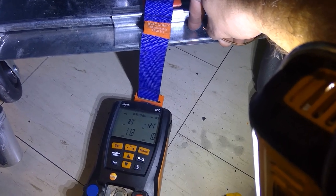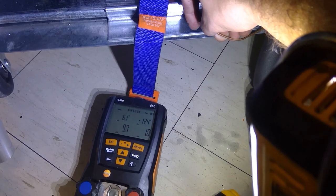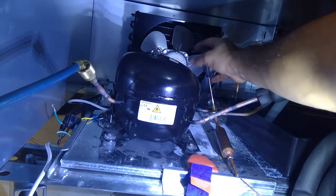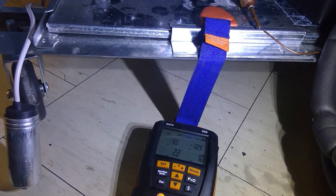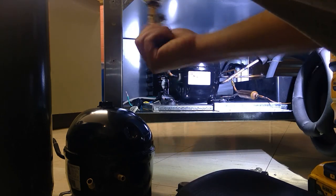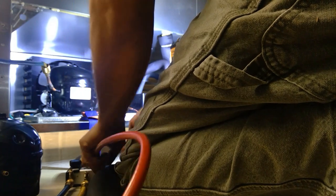Still really good pressure at 9 psi, so I'm confident there's no restriction in the cap tube. I'm going to let the rest of the nitrogen out and pull the schrader valve because I need to braze the cap tube back into the filter dryer. After brazing the cap tube back, I'm going to put just a trace amount of R290 into the system — you could also use R134a — for the leak test. I've dropped in about an ounce.